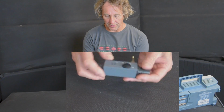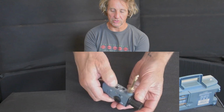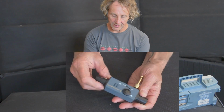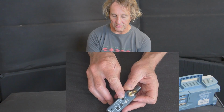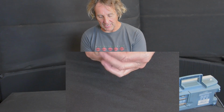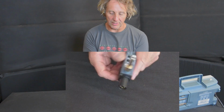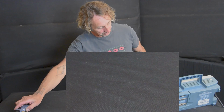Sound Bullet. We'll use this for pink noise tests. This thing's cool. It has a pink noise generator in it and a little speaker. Oh, a little tone. And pink noise generator, volume knob. We can plug the ears directly into this mini plug out and generate pink noise from it. We can also have the pink noise come out the XLR so that we can have two sources, and we can run that into Smaart, and it'll come in handy for testing.